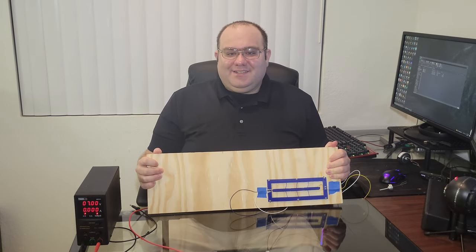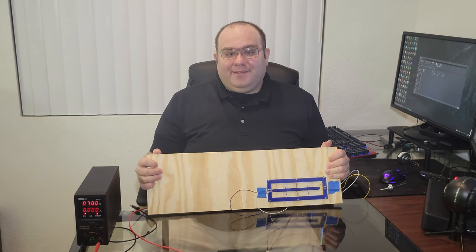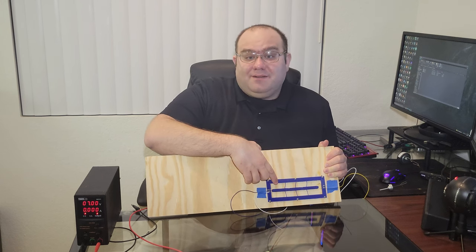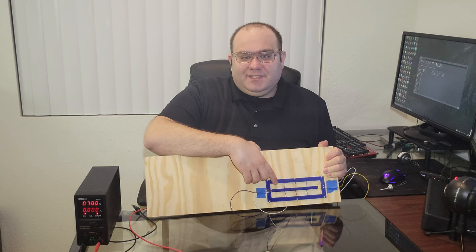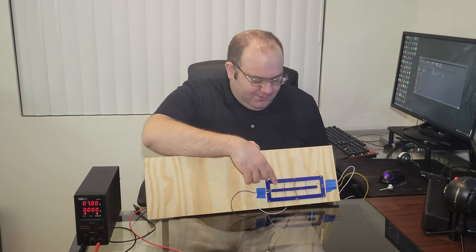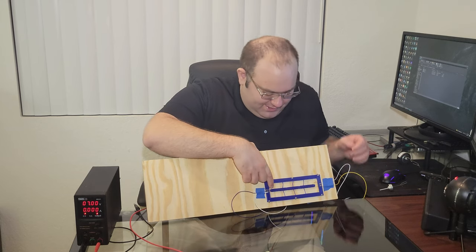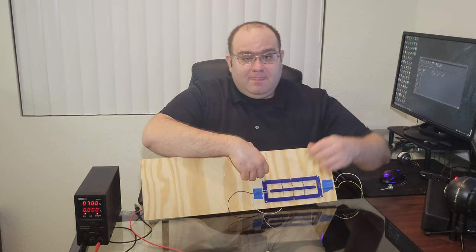The design is now a single plastic part, 3D printed with PETG this time. The adjustment features have been removed, and the slider now operates as a compliant mechanism. The flexures here operate much like the bistable torsion springs that come with the turnouts. They do a good job of holding the slider in place until just enough force has been applied to push it over to the new position.